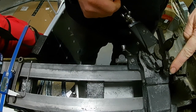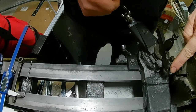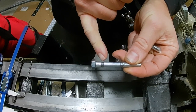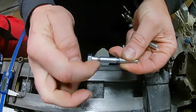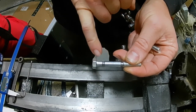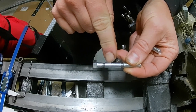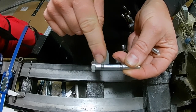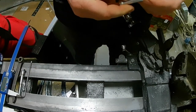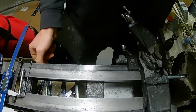The other important thing is that the tool you use for milling has a radius. The reason is that when these break off, a bolt sheared straight off can mushroom out on one side or the other. Having that radius gives the metal somewhere to deform without locking it in your center shaft — because if it deforms in the center shaft it's going to be a beast to get out. So you want a nice radius cutting tool.